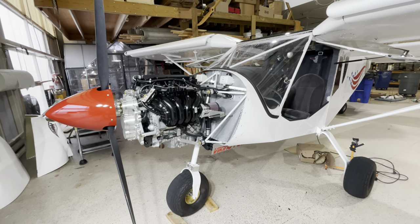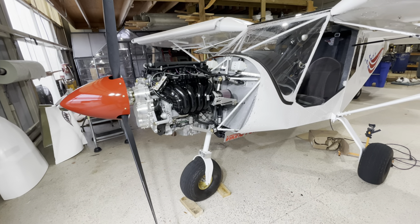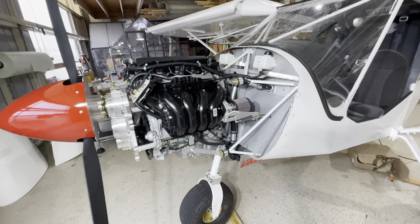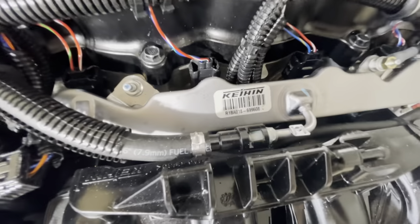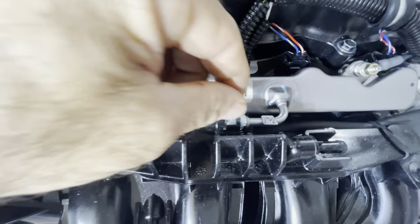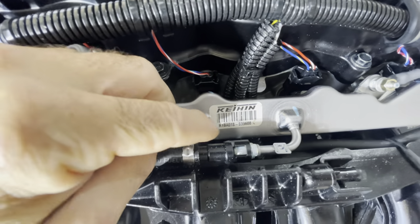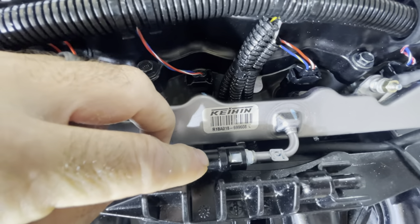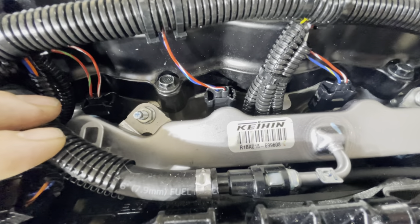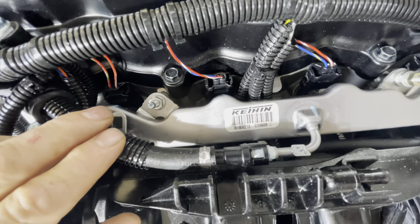The engine has to be fed voltage, air, and fuel. At the engine end, you'll have a quick disconnect — you squeeze the little tabs top and bottom to pull it out. To put it back on, lubricate it with Vaseline or O-ring grease and snap it on; there are O-rings in here so don't put them on dry, especially with fuel present. We use proper Oetiker clamps, and the tooling, hoses, and all these parts are in your firewall forward kit.